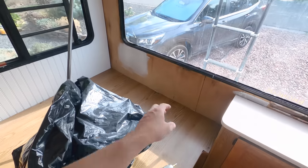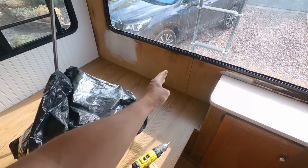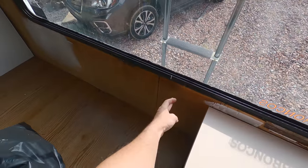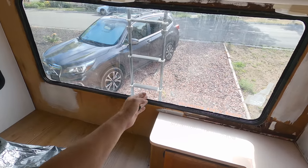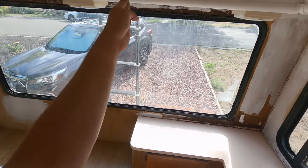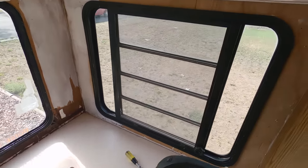To do this big wall, you have to take off the window frame, make sure all the damaged and rotted wood is gone, spray it with a mold killer, then seal it with a primer wherever the big moldy places were. Then I measure carefully — the sheets are 48 inches wide, so this is gonna be two pieces: one sheet goes to about this line here, then I butt up the next one, and then this section could be just one piece.